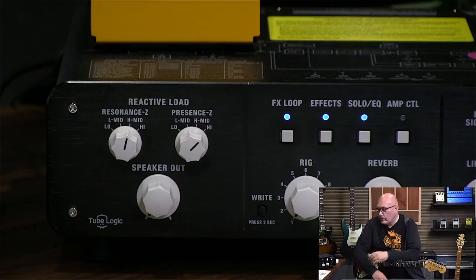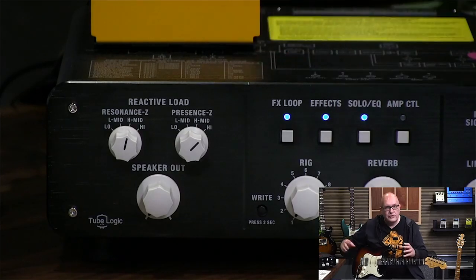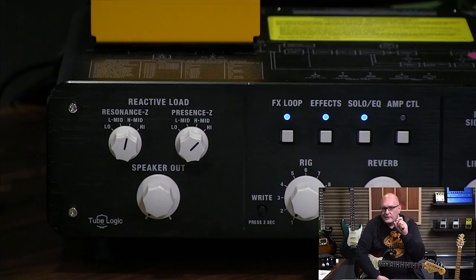I've learned over the years with tube amp expanders, one of the first things I try with attenuators, load boxes, and the like, is trying it with my clean sound. Because typically on a clean sound with an amp that's loaded down, whether it's a load box or an attenuator, the clean sound usually has artifacts around it, like little distortion artifacts. Not quite distortion, but you'll strum a chord, and it's not quite as clean as your amp sounds in the room. There's a little bit going on there.